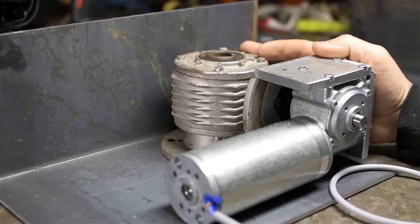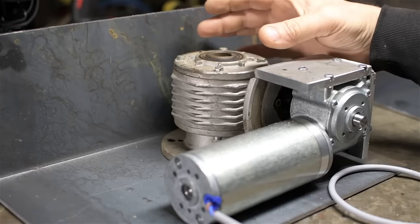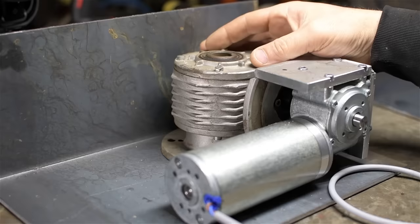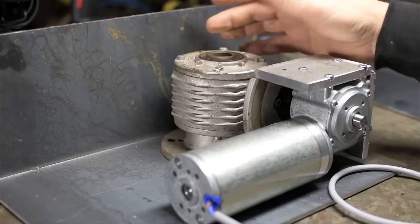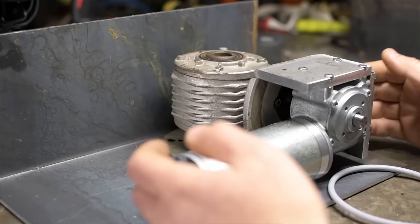The other downside is that I now have a small spindle bore. What I would like to have done is made this bore at least, I don't know, 2 to 2.5 inches. And that way, if any parts have sort of a tail, it's just like the lathe. If you want to sink parts into the chuck and into the spindle bore, the larger the spindle bore, the better. Here, I'm not going to be able to do that. I'll probably make this a hollow shaft just so I can get purge or back gas to a part if I need it. But I won't be able to nest any of the work into the 3/4 inch spindle bore. So I'm going to noodle this, and you'll probably see all the rest of this happen in fast forward. It's just going to be a bunch of layout and drilling holes.